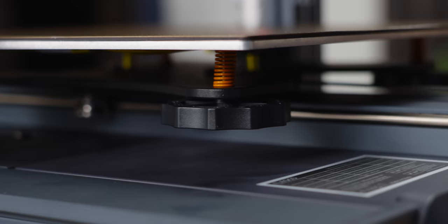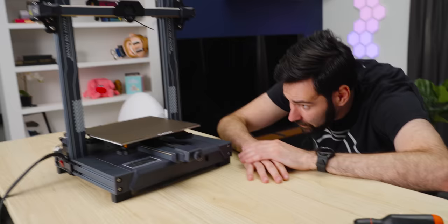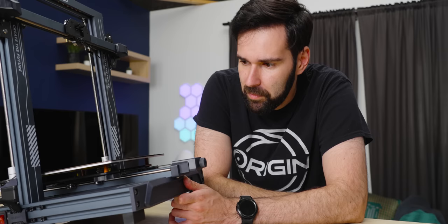We've got these four corner knobs and they're giant. They even say which way goes up and down, which is awesome — I always struggle with that because you're kind of above it and when you tighten it, it goes the wrong way. They've also used these really tight coil springs. My understanding is that these springs are from plastic injection molding machines. I use these on my printer at home and they were like the best upgrade I've ever put on it, because I never have to level the bed.